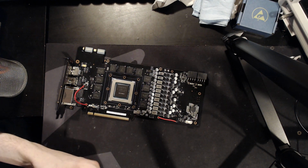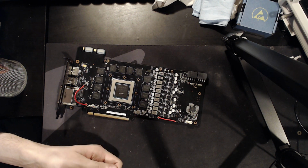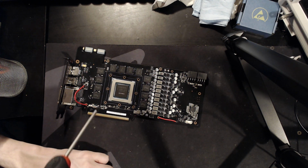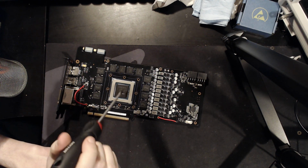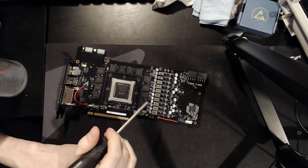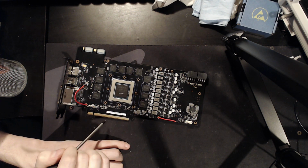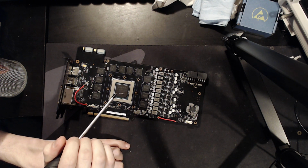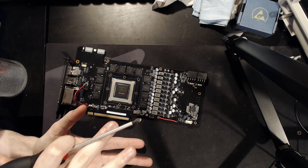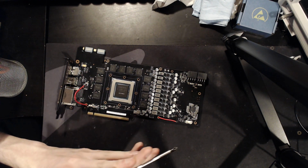I think GTX 480s and older NVIDIA and ATI cards very commonly have that issue, where the connection between the silicon and the substrate gets broken. Those are the cards that people manage to bake back to life at like 180 degrees Celsius. Those are cards with FCBGA damage, where the silicon and the substrate are disconnected. You can't reflow that connection, because it's not solder. The contacts basically get crushed into each other, and that's pretty much it.